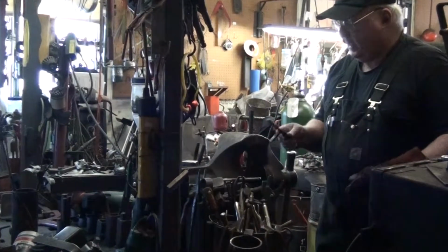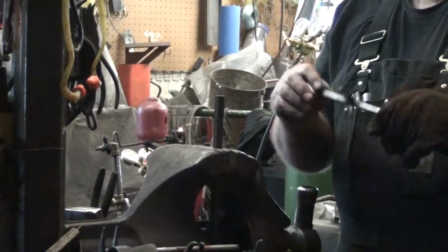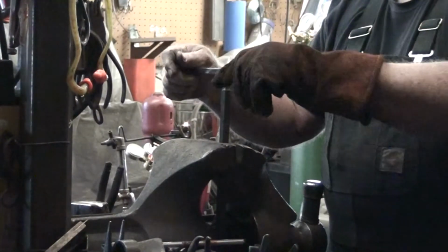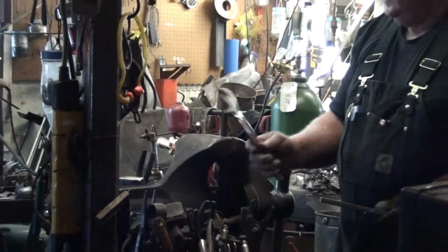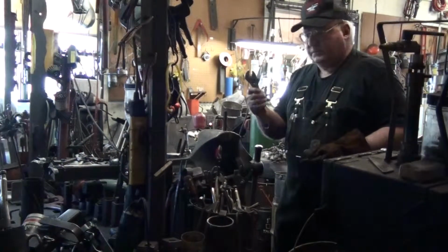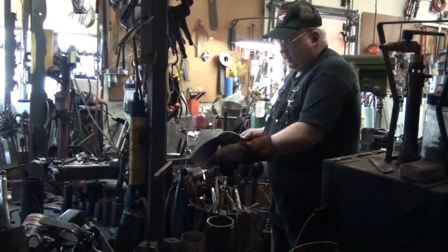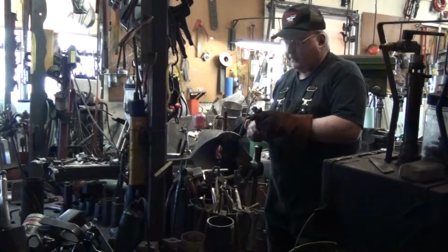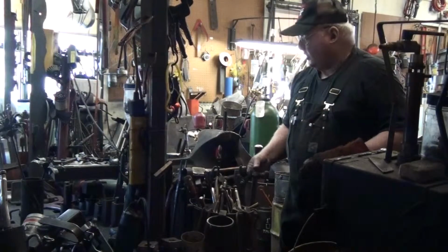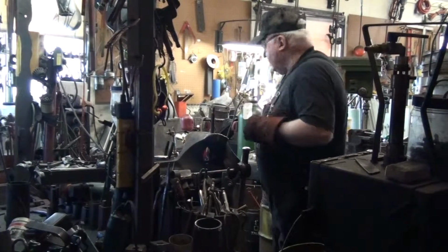piece of that stock locked in. I made a little tool out of 3/8 square solid, got a fit in there as a twisting aid. We'll see how that works. It'd have the advantage of being non-marring because it's internal, but then I have the trusty adjustable wrench, or could use a regular bending fork or specifically forged bending tool. We're going to do this with torch heat, and I'll start off with the internal tool.